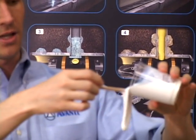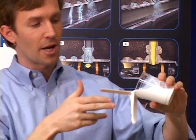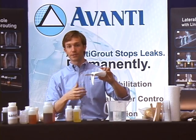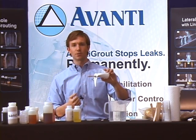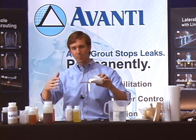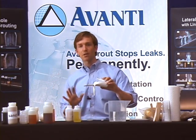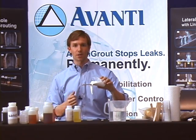We'll let this set here. It's created an impermeable gel mass that water can't pass through. Once it's mixed with soil, it's even that much more dense, and water can't pass through that as well. This is typically used for a technique called curtain grouting — you're creating an impermeable curtain on the outside of the structure, whether it's a basement, a vault, or a manhole. It wants to be in the soil.